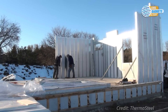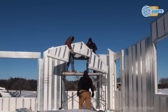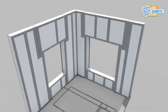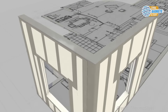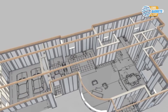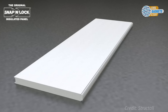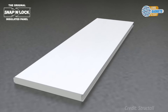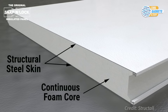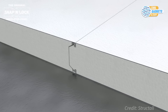There are several types of steel SIPs on the market. Thermasteel is a panelized building system capable of providing a non-combustible load-bearing building envelope. It provides exterior and interior walls, as well as floors and roofs. The panels are simply set into a base track and capped with a top track channel. No fasteners are required for the tongue and groove vertical joints, which have tight foam-to-foam contact. The top metal channel acts as a moisture and vapor barrier and integrates the entire wall and roof system together. Another company, Structal's Snap-and-Lock Insulated Panels, are comprised of metal skins rolled to form a unique locking system that easily snaps together with an energy-efficient continuous polystyrene foam core. The internal locking system eliminates the need for additional fastening methods at the joint, and a sealant is encased in the joint forming a waterproof seal.